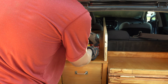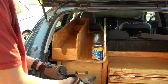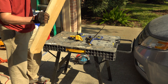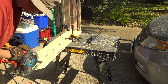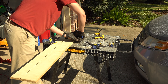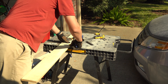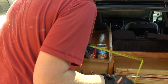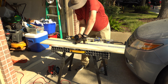Now I'm just putting everything in here. Initially I was going to have this taller, but now that I'm noticing it's going to have to open up, I'm going to cut this board down a little bit so the cans just fit inside. This storage area can really be for anything, though it can hold cans really well. Here's another mistake: this big cantilever edge hanging over and then me sawing it with the circular saw. You really need to be able to push down firmly or you'll cut uneven, which I do in fact do in this build. I would turn it around and do several small cuts with just a little bit of board hanging over — not a huge bit like I did.